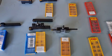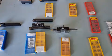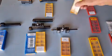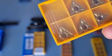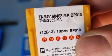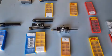A lot of the carbide bits in shanks being sold are neutral. The ones I've switched over to lately are negative rake — they're 16 millimeter bits. The first type is 16 millimeters and triangular. The designation is TNMG, so that's the code for that bit.